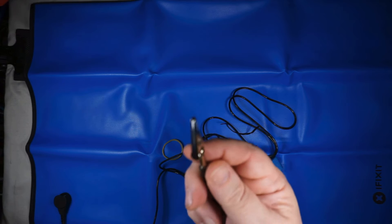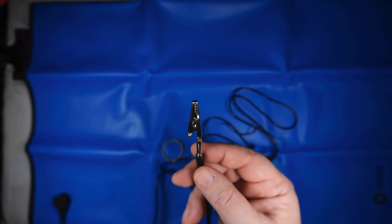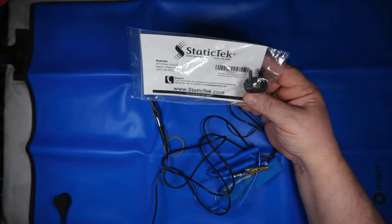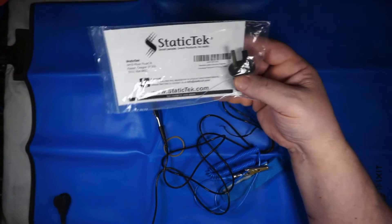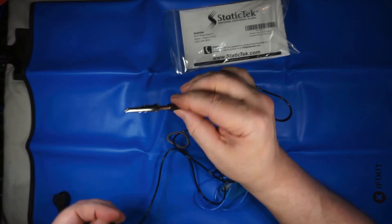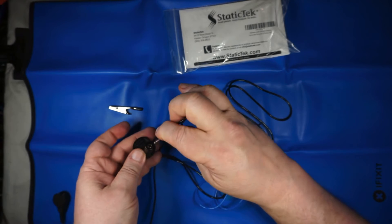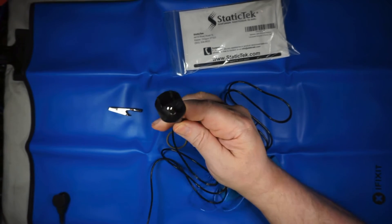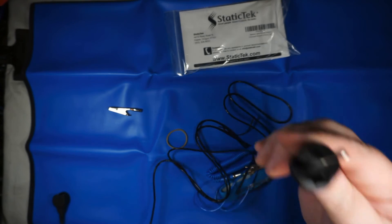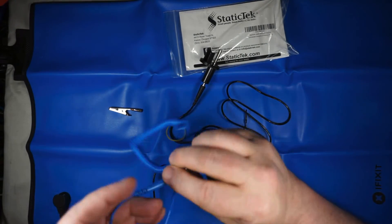Now, you've got to go to a good earth ground or electrical ground. And if you don't have ready access to that, we've got something that will be just the ticket for you. This is something you can also get at the same time when you're buying the anti-static mat. And what this does is this lets you use your house electrical ground as your ground. So you can just take off that little clip, slide this in right here, and then that goes into your electrical outlet. It couldn't be safer because it only has metal on the ground point. So you are getting an electrical ground now for the anti-static strip.